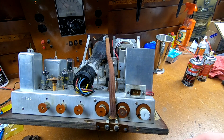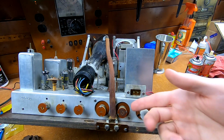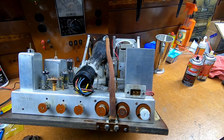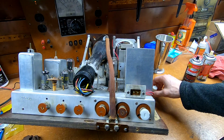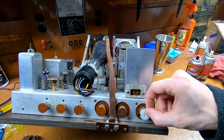And then I stuck it back in my lathe and parted this piece off to the correct width, checked it with my calipers, and then did the same thing on the round stock. Unfortunately, my parting tool was dull as crap, so I quickly touched it up with a file and then pushed into the material until it eventually started cutting. Came out pretty decently though.